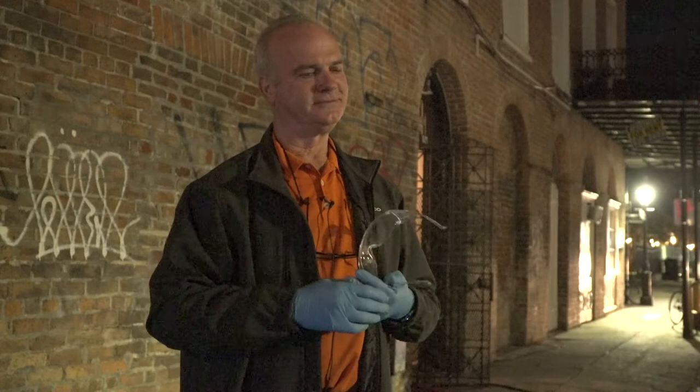It's just not something that you can say, this is exactly how you do it every time, don't change, because that ain't going to work. You're going to have to get familiar with your building. Your building's going to strip different than his building. It may be a different kind of brick. Your mortar may be softer. But the whole point of this is to try to explain the science, and you're trying to break it down and reduce the amount of pressure that you're having to use, because the pressure is doing more damage to your wall than the chemical.